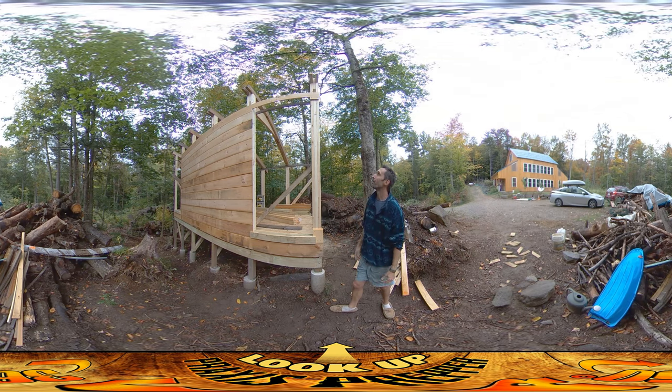A little damp today and tomorrow. I'm putting the boards up unsealed. When I did the house I sealed them first, then put them up — I'm doing it the other way this time. It won't be that big a deal to paint later since this isn't nearly as tall as the house, and I still need to do all the sanding on these boards.